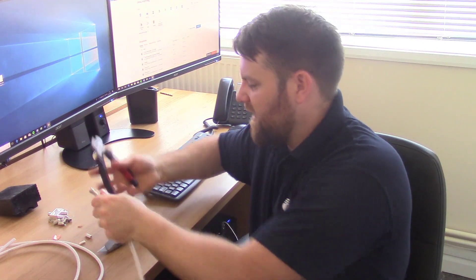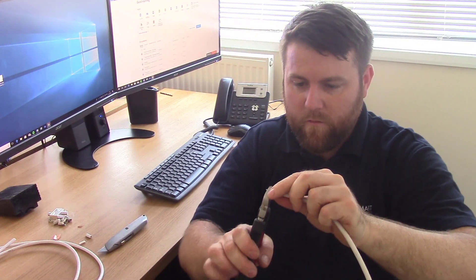When you're making F connectors on any sort of coaxial, you only need about two millimetres of centre conductor sticking out — what we call the stinger. I often go to jobs and they've been left much longer than that, which is completely unnecessary. Two mil is fine.